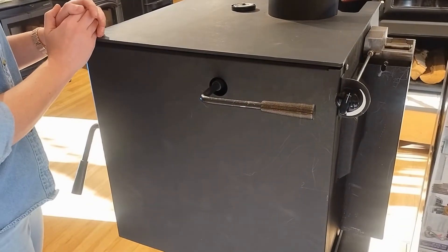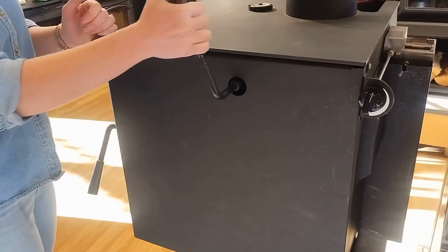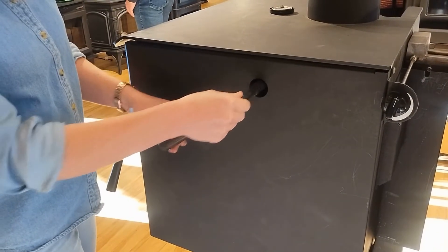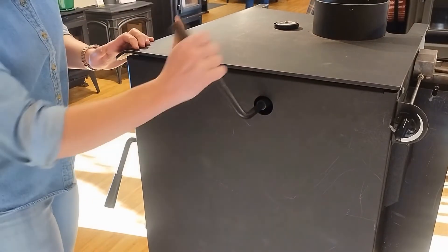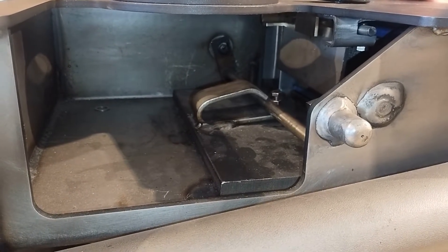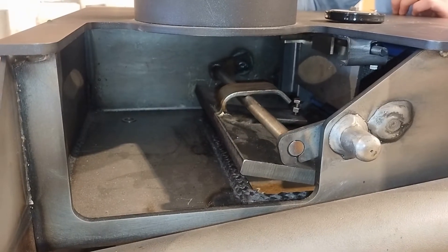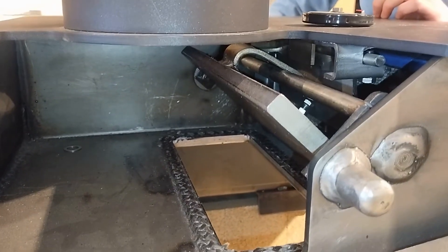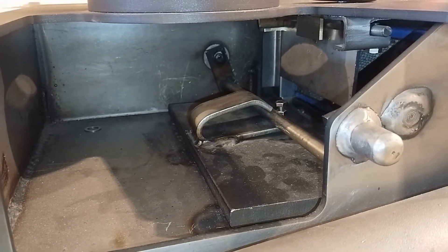On the Blaze King you will find the bypass door handle. This bypass door handle is closed. Now the bypass door handle is open when I have it pulled towards the front of the stove. The bypass door handle can come off quite easily, but there's only one way it can go back on. Now we're showing proper operation of the bypass door — right now it's in the closed position. We open it by pulling the lever towards us. You see that horizontal rod cams along the metal within the bypass door to open it. Then we close it by pushing it all the way down until it locks into place.